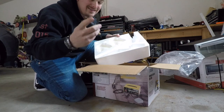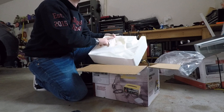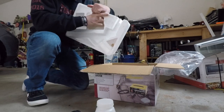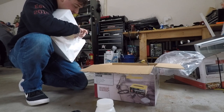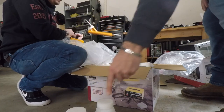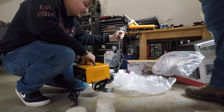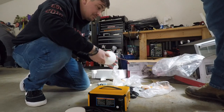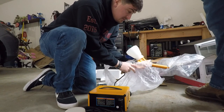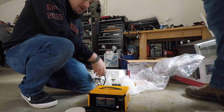They gave us an inline filter, which is nice if you don't have an air filter in your line already from your compressor. Another note is this thing can run on the little pancake compressors. We got two tubes to hold your powder — holds about a pound of powder apiece. This is actually the whole kit, super simple. You take your tube of powder coat, you screw it onto the gun. This is a gravity fed gun, it appears. Hook it up to your air compressor, clamp this to your work piece for voltage, and then use the foot pedal to activate it and plug it in.